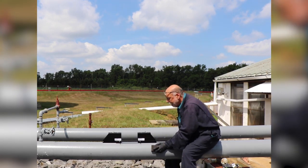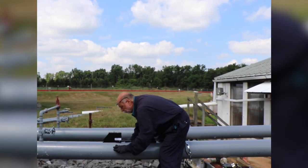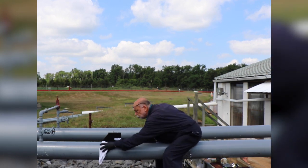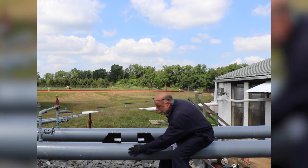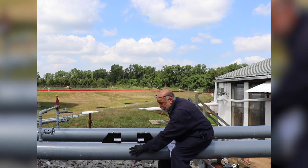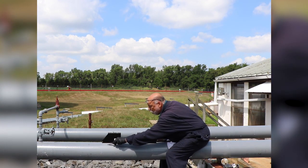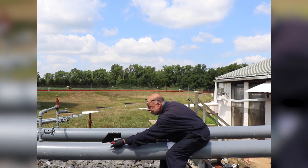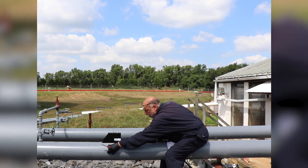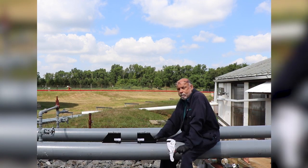So both on this side and on this side. Basically what we did is we sanded off the glaze that was on this pipe and made it as smooth as possible. If there was any flaky material like you see here, you'd want to remove that before you do the sanding. It's not necessary in this case because we're going to be mounting at the 10 o'clock position and this flakiness will have no impact on the measurement.